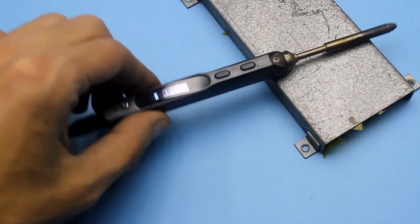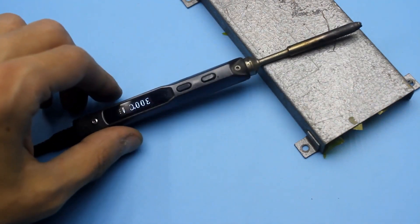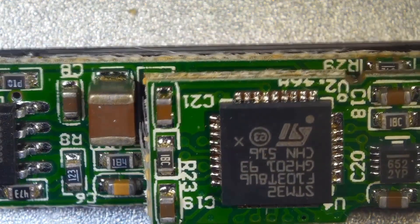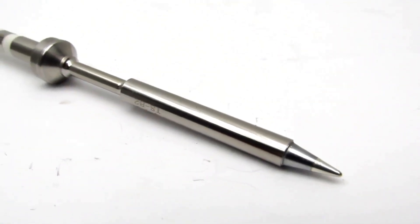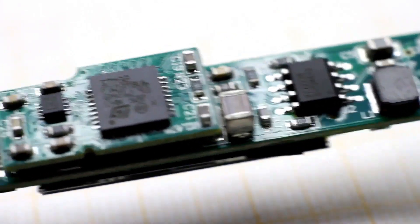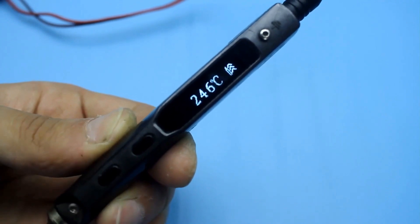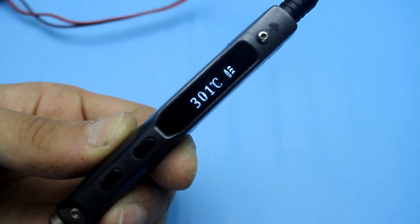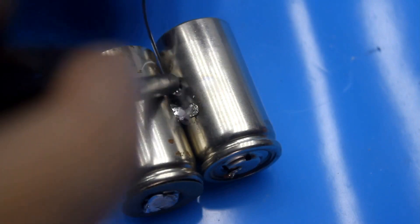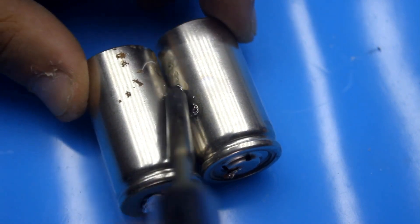As soon as you pick up the soldering iron, the accelerometer will activate and automatically start heating the tip to the temperature you previously set. The biggest feature is the smart heating system. As I mentioned earlier, the thermocouple in these tips is as close to the tip as possible. The PWM control system will automatically increase the power — it will always try to maintain the set temperature at the tip very quickly. This feature eliminates issues such as an underheated soldering iron, lack of power, and solder cooling due to low heat capacity of the tip, along with other problems familiar to every electronics hobbyist.